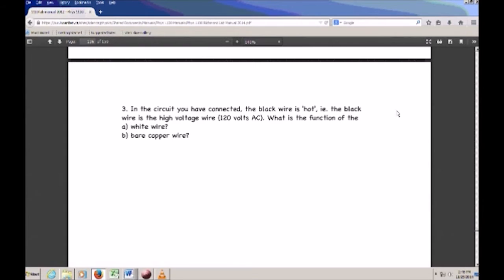So the big hint I'll give you here is that though they mention voltage, this question's all about current. So current means electrons that come out of the wall, through the wires, through your appliance, back out through a different wire, and then back to BC Hydro. So current is little physical bodies moving in and out of your circuit. They need to go in via one path and out via another path. So 2 of the wires that we're talking about have electrons, have current flowing through them.